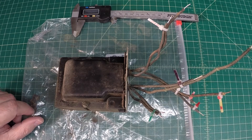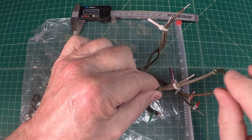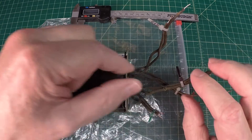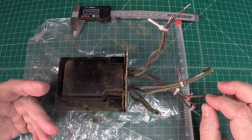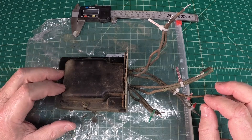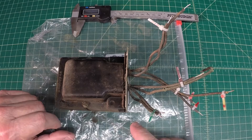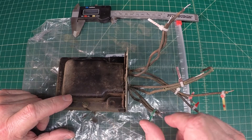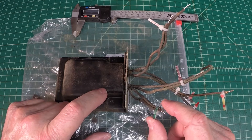So what I noticed — I had some fraying of the wires, you can see here. What I'm thinking about doing: we'll pop this bell cover off and see if this is wired back to a terminal inside the transformer, or if it's a direct winding into the transformer. In most cases there's enough room — I can probably do some splicing inside the bell cover housing.